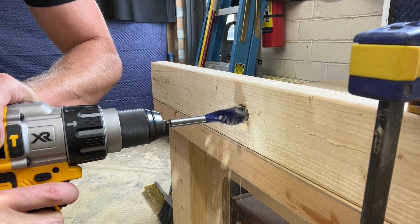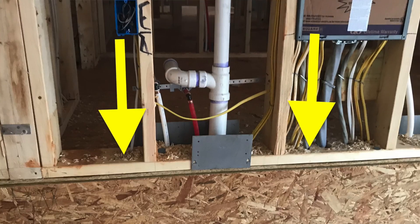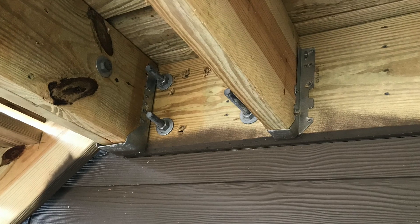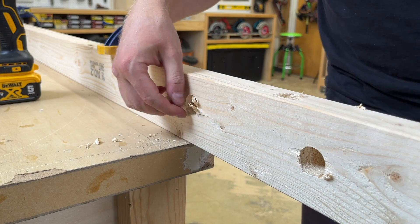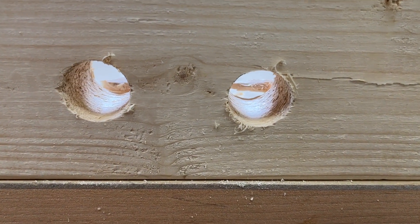Used effectively, speedbores are the ultimate design for quickly boring through dimensional SPF lumber. That includes pass-through holes for wiring and some piping, and also pre-drill holes for bolts and lags in decks and other types of framing. Just remember that because they're so aggressive, they suffer from blowout at the back — they'll often just burst through in a shower of shredded wood pulp. And really, their entry hole isn't that clean either. So they're only for rough or concealed applications — more construction than woodworking.